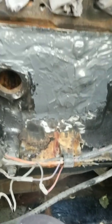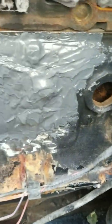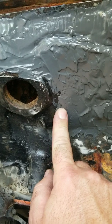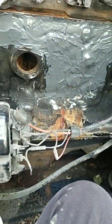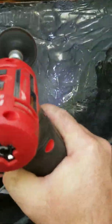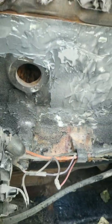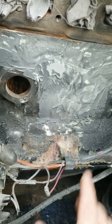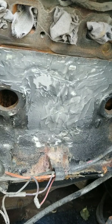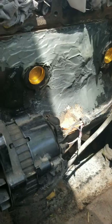It's the next day. The stuff dried pretty good — I just globbed it on there everywhere I could. I'm pretty sure you can see that crack behind there. I'm pretty sure this would hold no problem and I don't think this is going to have any issues. I've got some more JB Weld — JB Weld usually either goes bad or gets lost while it's sitting. I'm going to use a little bit more just to thicken it up, go through with my sander to rough it up and give the new JB Weld a place to bond, then cover up this crack a little bit more. Let it dry for another 24 hours, then come back and paint it and start putting it together.